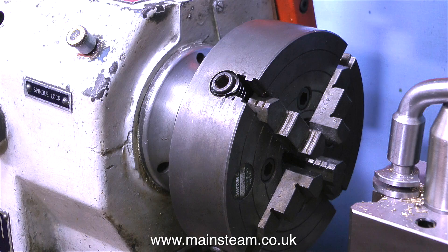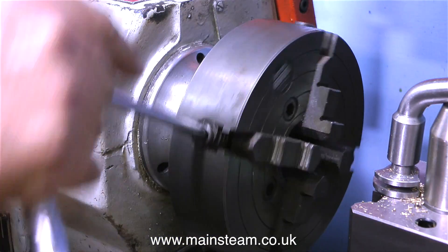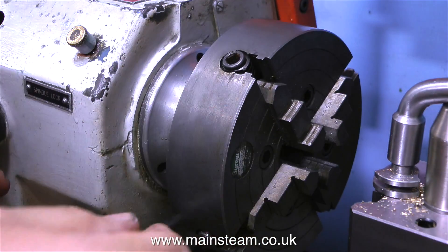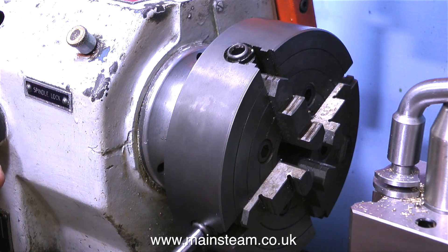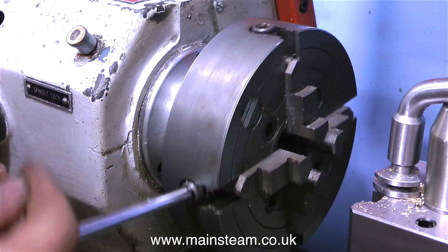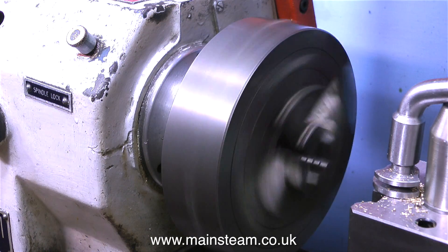It is vital to make sure the chuck attached to your lathe is tightened securely. On the old Boxford there's a button which locks the spindle - it presses on a piece of metal that goes into a hole in the spindle, locking it in position. That allows you to put a bar in the chuck and nip it onto the register. As the key for this four-jaw chuck has been lost, improvising with a socket extension bar - okay but not ideal.